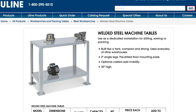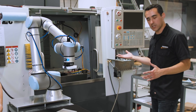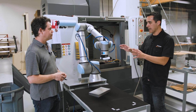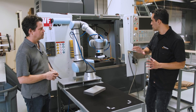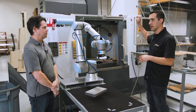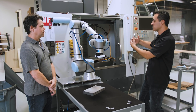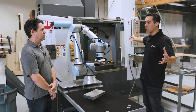It's heavy, so when you hold the largest pallet way out at its 51-inch reach, it doesn't tip over. The other issue was that almost all controls were spread out: the robot control box at the back of the machine, the pendant running up to the front, all the sensors, pneumatics, and actuators at the back. We were splitting our attention between the front and back of the machine with cables and wires going all over.